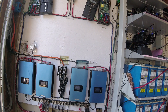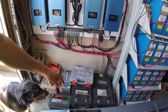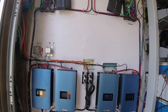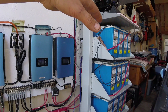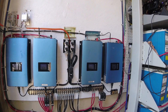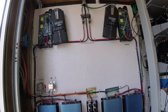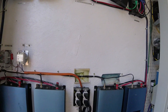There are three of those CD Technologies batteries — those are old telecom batteries. And those big batteries there are out of gensets, generators that have been replaced. They're still good. I'm running a 48-volt system, so I don't have the proper quantity to add another string. And even if I did, I'd like it to be matched so everything charges correctly — I probably wouldn't do that unless I needed to, or I built another smaller system maybe on the shop. But I'm pretty happy with this. It's a relatively inexpensive system. I'm very happy that I built it, and so far it's performing as nicely as I wanted it to.